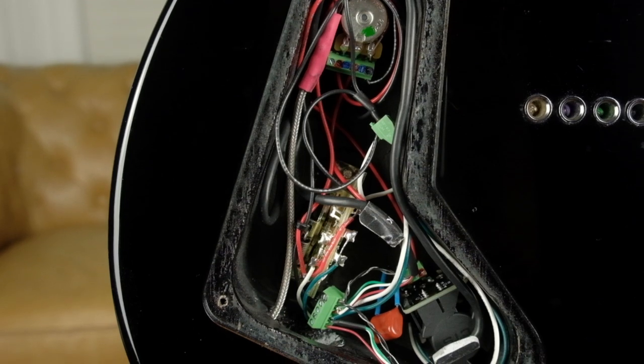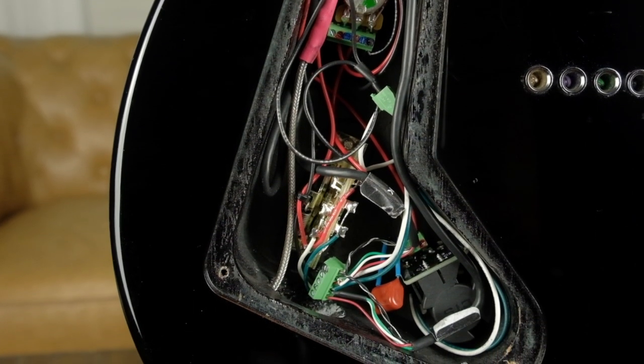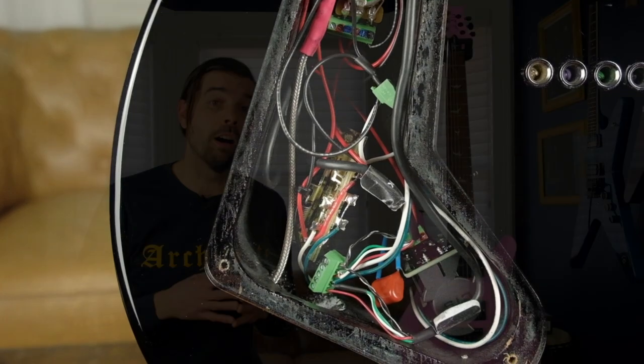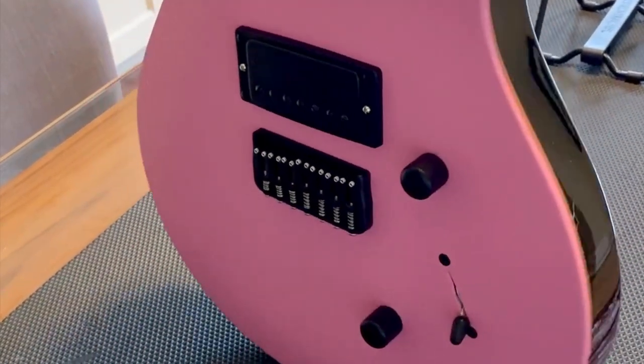They're a little bit on the expensive side, especially if you're comparing against buying just raw components and soldering it yourself, but they are very high quality, fantastic products. And the nice thing about this setup is that the tone knob is a push-pull CTS pot, so when you pull that sucker up, it splits the coil of my pickups and I get a fairly versatile sounding guitar. So this gives me sort of that single coil sound when it's up and it's back to humbuckers when it's down.